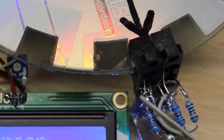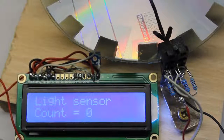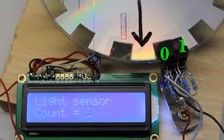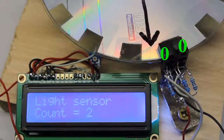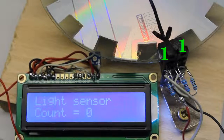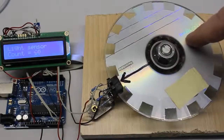The push buttons can be replaced by 2 photosensors scanning a toothed disc. Caused by the pattern of the disc, which is an old CD, there are 4 different switching states of the photosensors. The microcontroller can indicate whether the disc rotates clockwise or counterclockwise, thus the magnitude of the variable is raised or lowered. 60 pulses give 1 revolution of the disc.